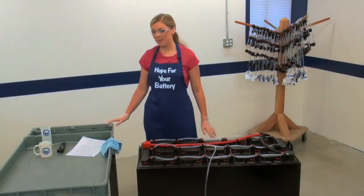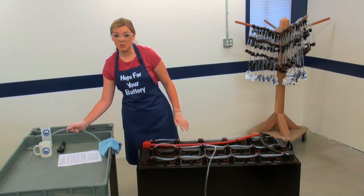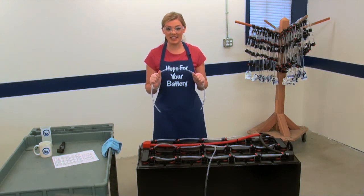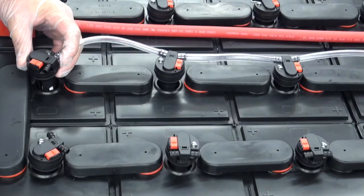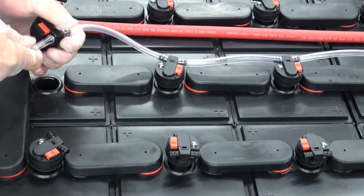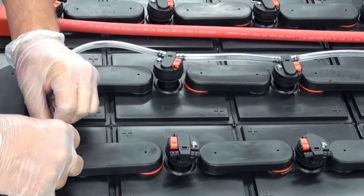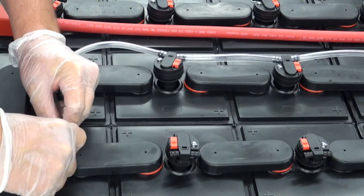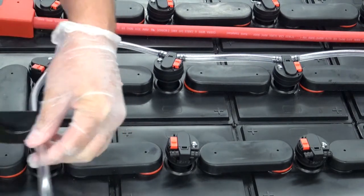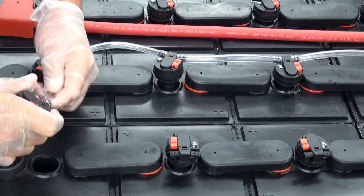Now review the drawing and make sure that your layout is correct. Additional tubing is provided with the partially assembled kit. The tubing is used to connect the ends of the strings together. Push the tubing all the way into the barb so it is flush with the valve. Once you have connected the end of the tubing to the valve, leave a loop in the tubing. Measure the tubing to the middle of the valve you will attach it to, and cut the tubing squarely and evenly.